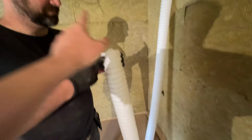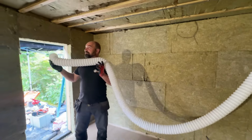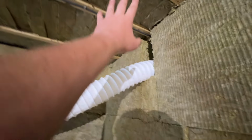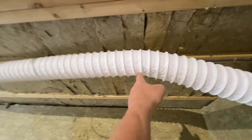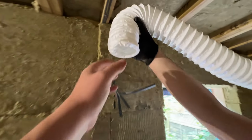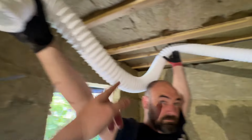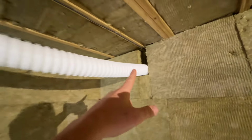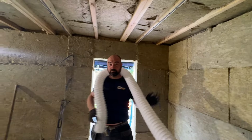Now, this vent could go somewhere over there. So if PJ takes that over there, imagine there's a wall in front of here. There's going to be another ceiling as well. So this can go up here in between the 2 ceilings, and then it comes out the second ceiling through the plasterboard, and then it's sucking air from the room through here all the way to there, into that fan, and then out of a vent outside. Do you get that so far?